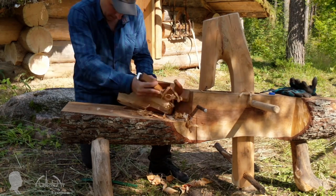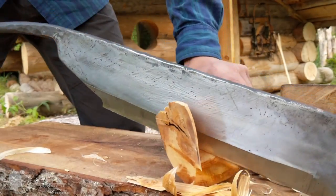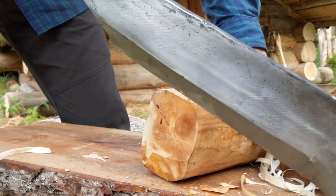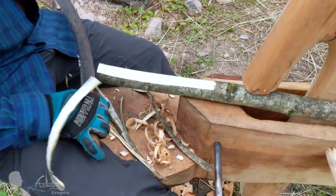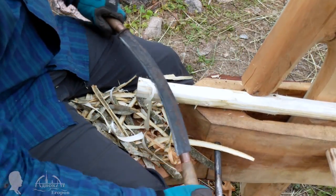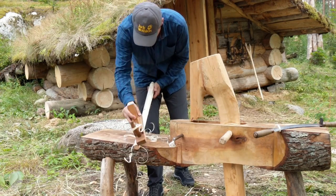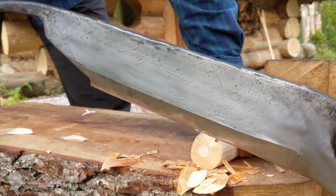The scrub plane actually works faster and cleaner for such tasks. As for shaping or cleaning the mallet head's face, the clogger's knife is a perfect tool — it literally takes a minute to clean up a smashed or chipped mallet's face using it. I shaped a slightly tapered maple handle so that one end is slightly thicker than the mallet head's eye. Note that the handle's thicker end shouldn't be cylindrical, but rather oval, so that it spreads the head's cylindrical eye along the grain. If the handle is wedged across the mallet head's grain, it will just split it.